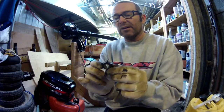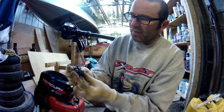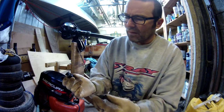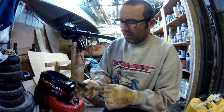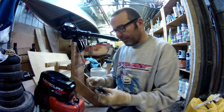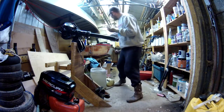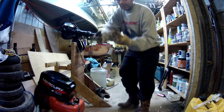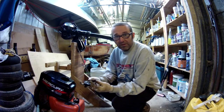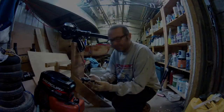That's the one I took out with the two vanes bent the wrong way, and here's my new one, which I've covered in grease ready to go in — it lines up perfectly. You've got to be careful with greases because a lot of them affect rubber, making it swell up. This grease is safe — it's what I use at work for similar things, pretty inert on all rubbers. It's called jet grease, or at least that's what we call it at work.